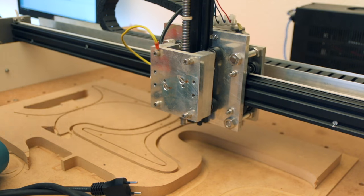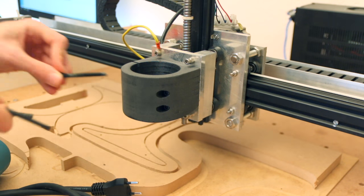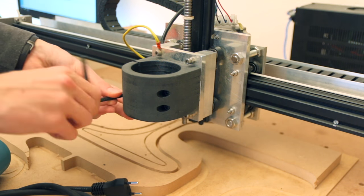This looked pretty ugly and it was still warped a lot, but the printer eventually got some height and the print went really smoothly with a good finish. The reason I printed it in ABS and not PLA like I usually do is I wanted it to be really strong — this black ABS is the strongest material I had on hand. After my little hack the print finished beautifully, I cut it off the build plate easily, and cleaned it up with a heat gun. I designed the bracket to use the existing bolts and screws from my old mounting mechanism, so the conversion was really simple and I had the new router bolted on pretty quickly.